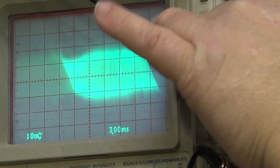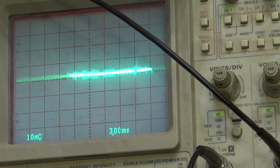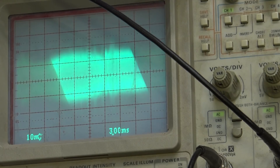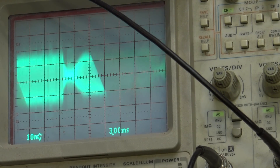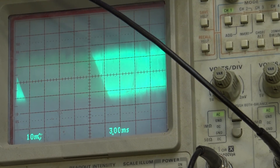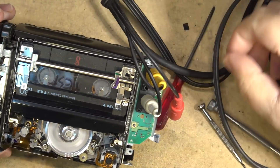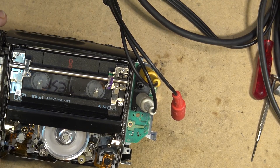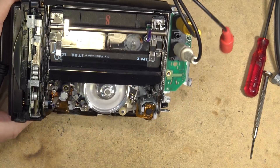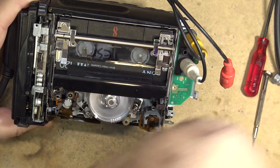There's my RF — looking pretty darn good. If I just move one of those guides while I've got the probe on here, you'll see that it does change the RF. There's the entry guide down and there's the entry guide back up. I eyeballed that without putting the scope on it, just looking at my TV screen. That just goes to show you that if I can eyeball this just looking at a monitor, then any idiot can do it — because it's not that difficult if you look at the screen and know what you're looking at. The entrance side is on the supply side.